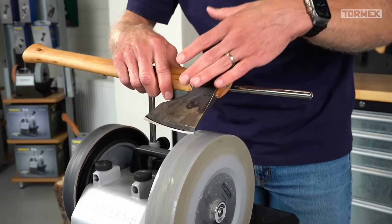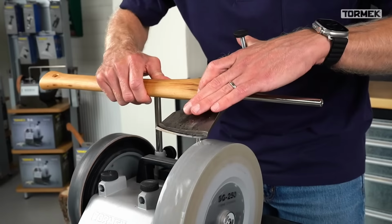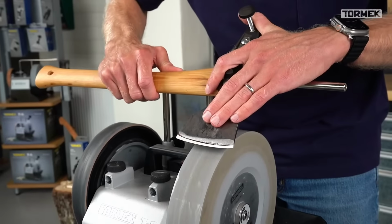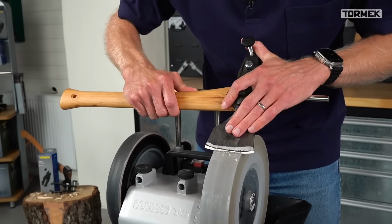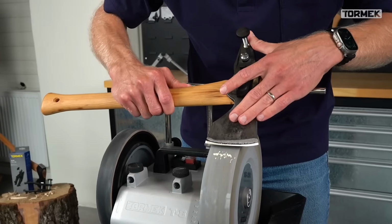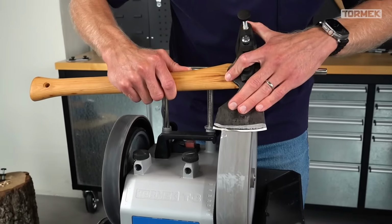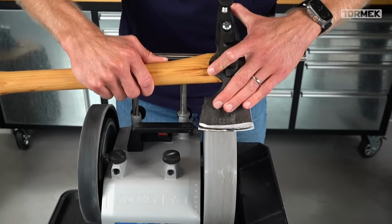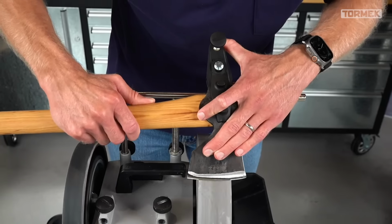And here as well, it's a bit of what you are most comfortable with. I often recommend that you are close to the bevel with the fingers. I feel you have better control there, and also you can put some pressure if you want to make the sharpening a bit faster. Then I just place it down, and if I would have a line on the stone, I try to follow that line as well as possible. Are you putting any pressure on there? Not that much now. Often I think this steel is quite soft, so I don't need to put that much pressure on it.